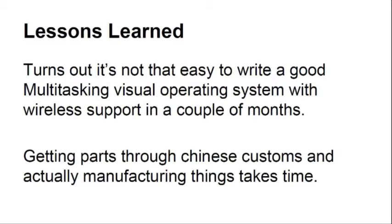But yes, to get all this stuff talking with each other, you've got screens, you've got motion processing, radios, all the LEDs and sounds. You really need this multitasking, FreeRTOS, to be able to run all this code in and out together, and there's an awful lot of code there. We split it all up and still didn't get it all done. So yeah, multitasking is hard. And trying to write a GUI on a very tiny screen, the font, you know, there's a lot of stuff being displayed in landscape because the screen's just not big enough. I can't get the resolution.